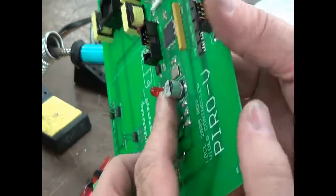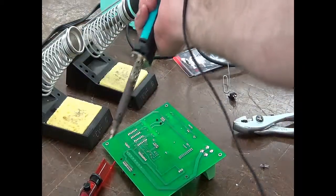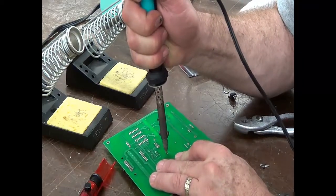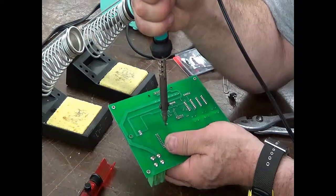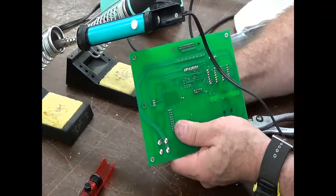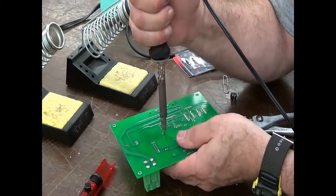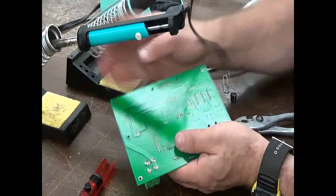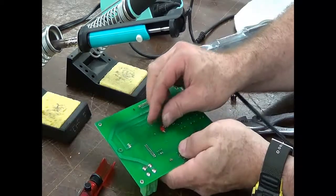We have this LED here. I'm going to go through that again and show you the removing of the LED. Clean the tip, prime the pump away from the board, and come in here and heat up the first pin, loosen it up, and suck that solder out. Now come down and hit the next one, loosen it up, and suck that solder out. The second pin is nice and loose, but the first pin is not. So I'll come back in and heat that up again, make sure it's loose — I can feel the LED wiggling on the other side — and suck it out. Then reach around and pull the part out. Nice and loose — and there's my removed LED.